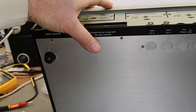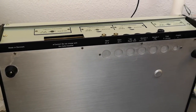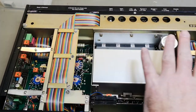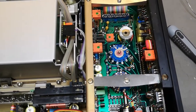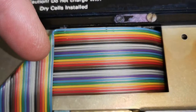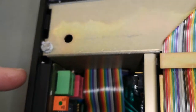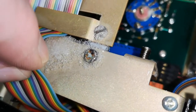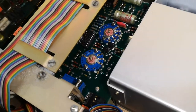I need to open it up — it's super gross and sticky and you get those slimy fingers. Now we're looking inside, and you can imagine the battery acid leaked out on this bottom plate and transported itself all over the place. That screw for example — we need to clean all this corrosion. Some of this has dripped down into the switches, so I better do a lot of cleaning here.